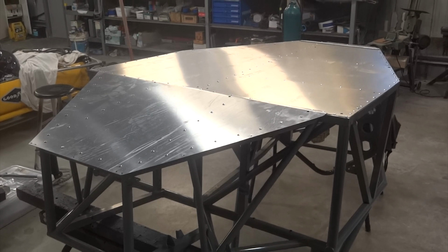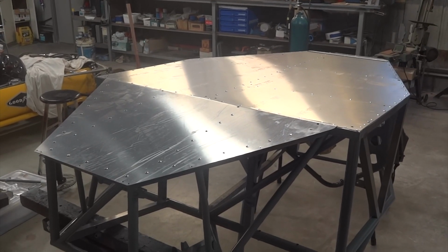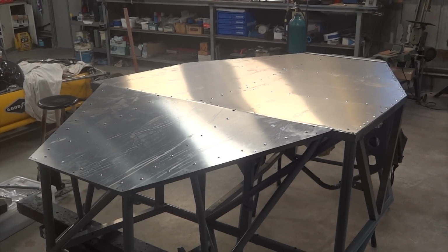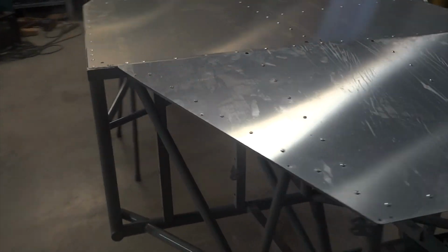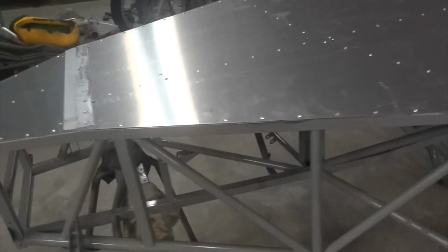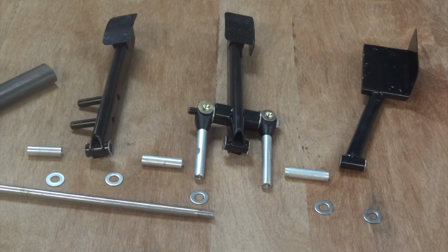And that's a 4mm rivet every 70mm, and a load of JB Weld, rather good glue. They're rated at 27 megapascal shear strength, which is pretty impressive. So that's what I use. Should be good. These little guys have been around for a little while, but you haven't seen them yet, so here they are before they go in the car.